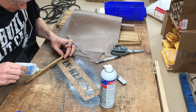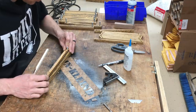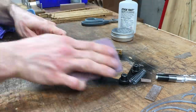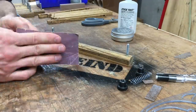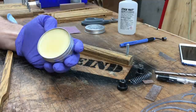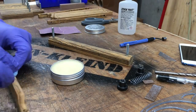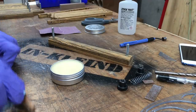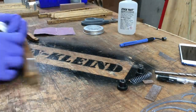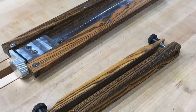The last step is to put a little bit of cork rubber on the top of the press just so that the blank stays in place as it's being tightened down. Then assemble it and test it out, sand down the corners, and put a little bit of finish on. I'm using Alfie Shine, which I really like — this is what I use for the pencil tool rails. I use a little bit of heat just to soften it up and make it go a little bit faster. There it is — perfect match with the pencil making tool.